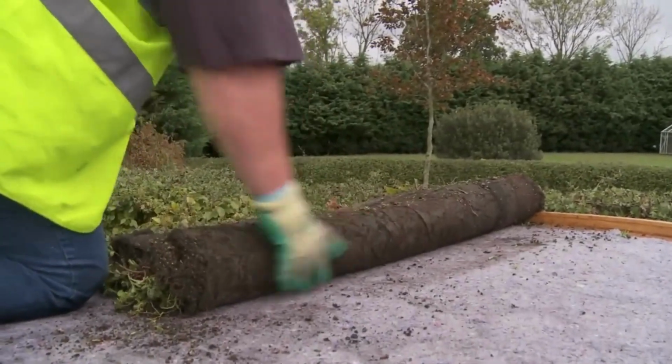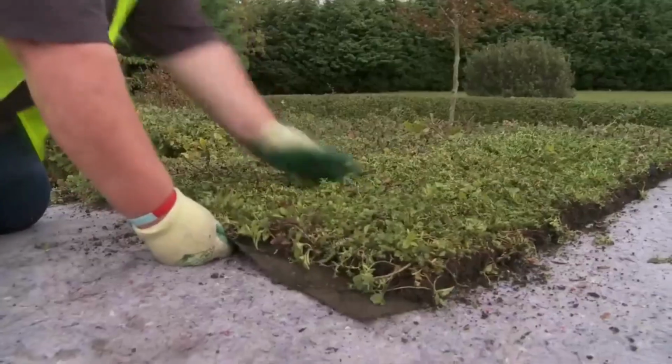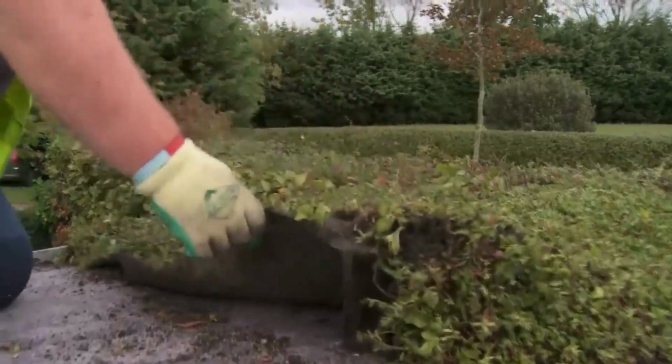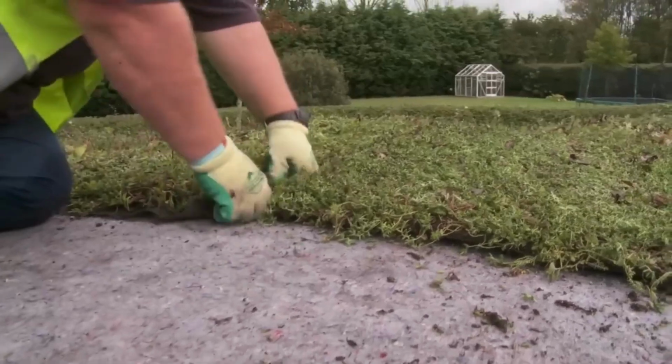Start at one edge of the roof with the Meadowmat at the eaves, then roll it upwards. Each roll of Meadowmat will have a fabric flap folded underneath it. This is to help with anchorage. Unfold the flap and lay the next piece of Meadowmat on top, with the edges butted up close together.